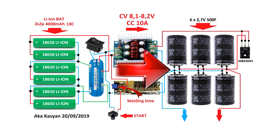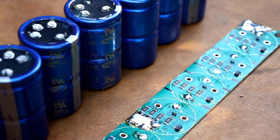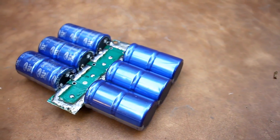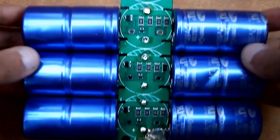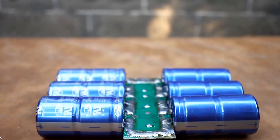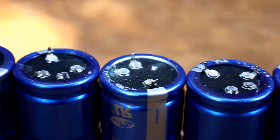Now let's examine the construction in more detail. The capacitor battery initially consisted of six capacitors connected in series, all located on a single board. On the same board, there is a balancing system, or voltage equalization for the capacitors. After numerous experiments, I decided to desolder all the capacitors from the original board and assemble another battery, where two capacitors are connected in parallel and three assemblies of two cells are connected in series. Our battery has a capacity of about 330F and an internal resistance of only half a milliohm. One could use more advanced capacitors, but I was content with what I had.